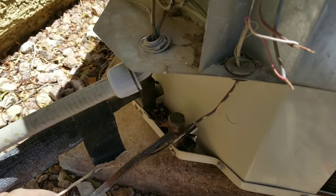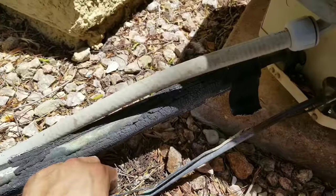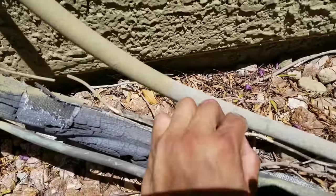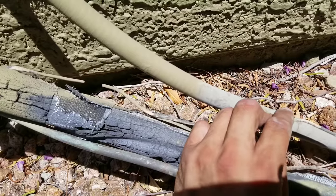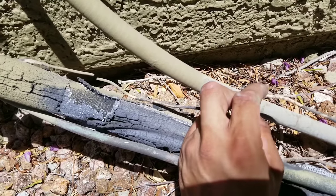The thing you want to do is trace your low voltage wire. I've already traced my wire all the way through and I found the problem — it's going to be right here. My low voltage wire has obviously been cut.